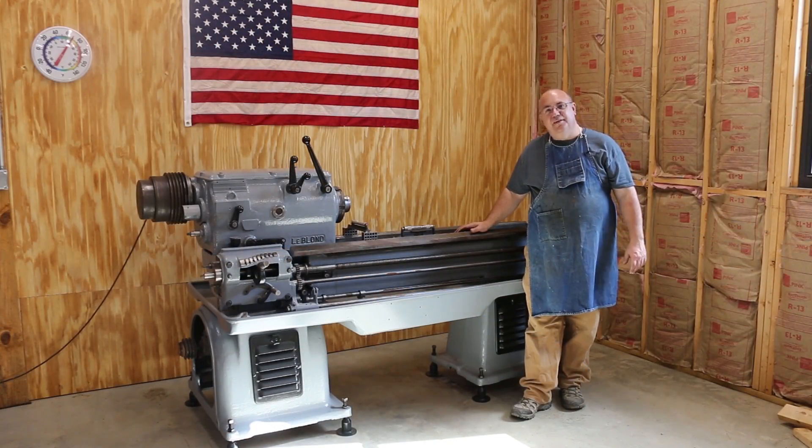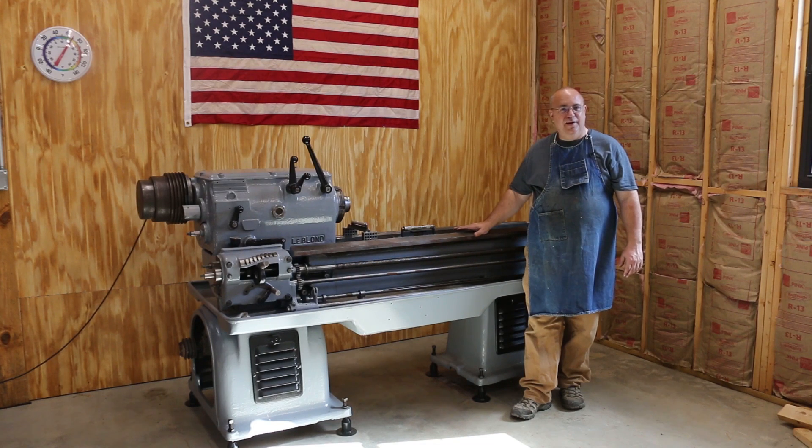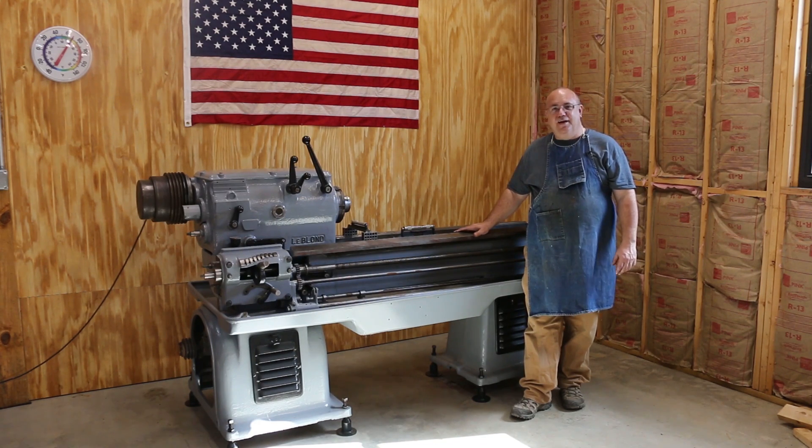So there you go — there's the process I used to level my lathe. It's not rocket science. It just takes a little patience, a little bit of fiddling around and getting things just right. But it is a very important step and something that everybody with a lathe should make sure they go through. If you don't do this, if you just plop it down on the ground and let it sit where it's at, you're very likely going to be frustrated with the results you get on your machine. But if you just take a little bit of time to get it level, it will work much better. So with that, that'll be a wrap. Thanks for watching guys, and we hope to get a little bit more done on this lathe restoration now that we've got it where it's going and actually have some room to work on it again. We'll be bringing you more on this series over the next few weeks. Thanks a lot.